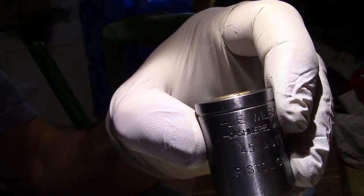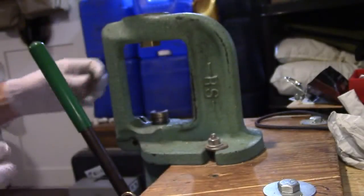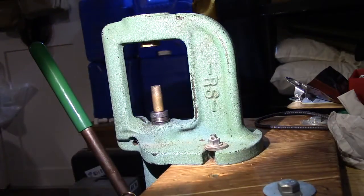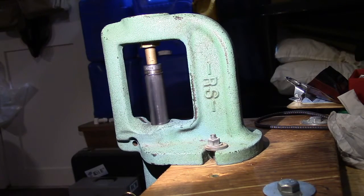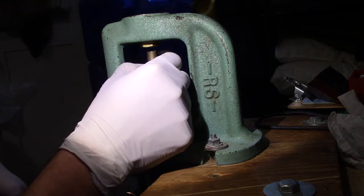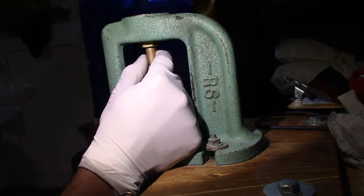Several thousandths above flush, so we're not quite done yet — I kind of figured that would happen. I'm going to give it a little more lube because the last thing I want is to apply a lot of extra force, overshoot it, and ruin the piece of brass after all that work. So we go back up to our witness mark, then just a little bit of force — I mean just a smidge. You'll feel it move before you see it move. Back out, give a little turn to allow for anything that might have shifted, and just back up to that same point.